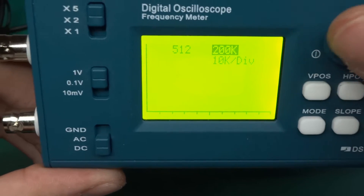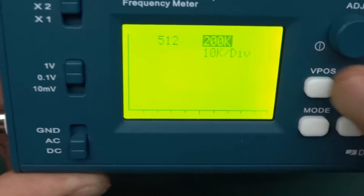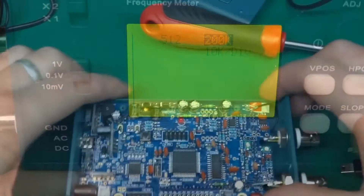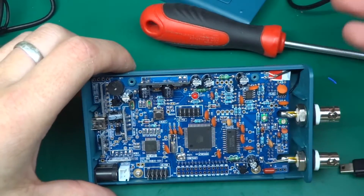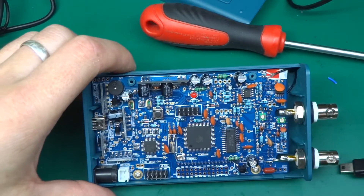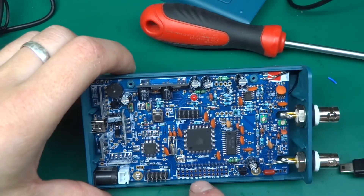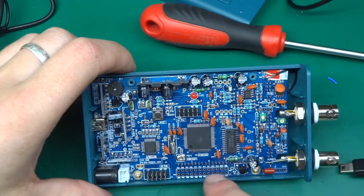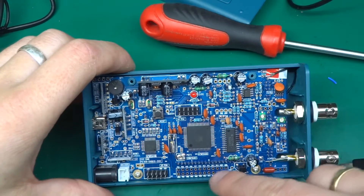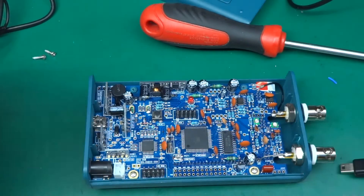Okay, it's got to the screen but as you can see it's not responding to any key presses. Apparently to fix it and clear the EEPROM memory, we have to pull down the PF6 pin to ground with a 1k resistor.